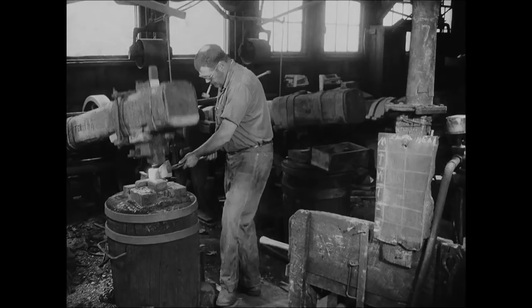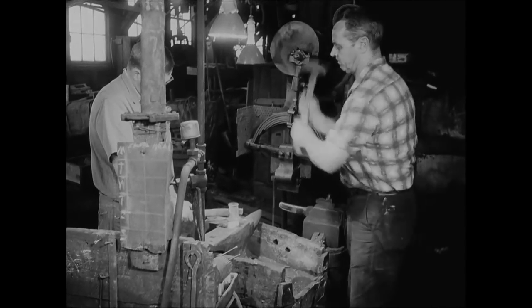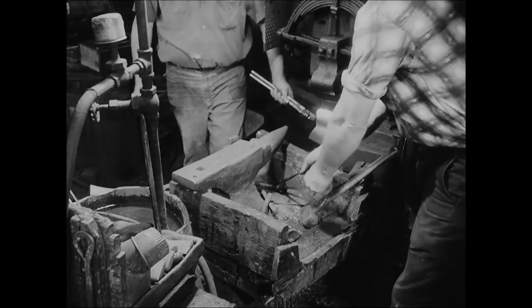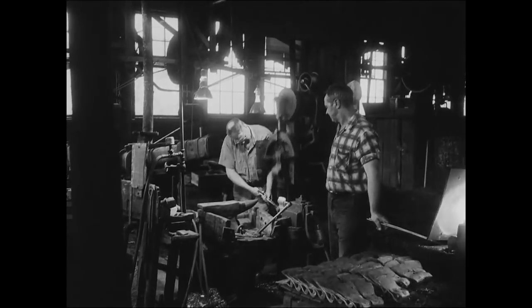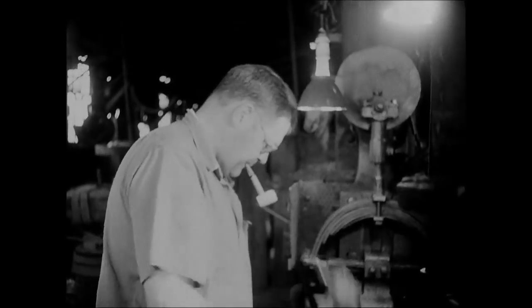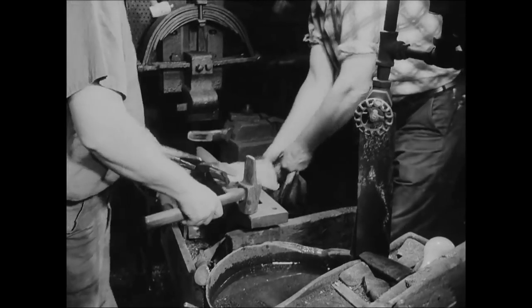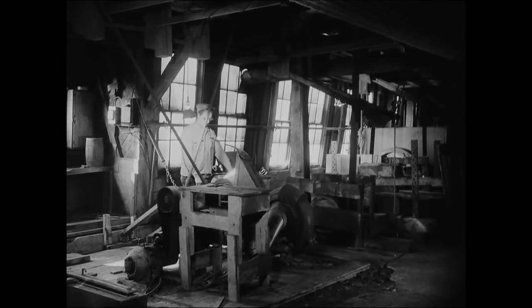Smooth and slightly tapering sides are permanently set under the trip hammer and at the anvil. The head is at last squared off by the percussive strokes of the rapid hammer. And finally, with a few light blows at the anvil, Manson has completed forging an axe. The forged axe is now ready for grinding.